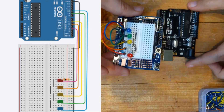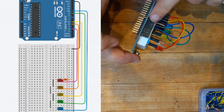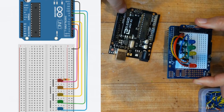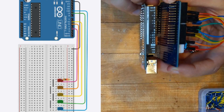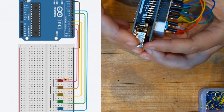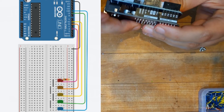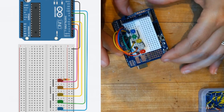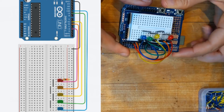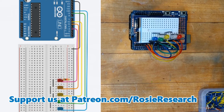What we can do now is attach it to our Arduino Uno. The way you do that is you want to line these up — there's a big gap between these two pieces and a little gap here. The big gap is between the power and the analog rails which are on the side next to the computer chip, whereas the little gap goes with the longer piece. You want to make sure that your bottom pin goes into pin zero right here — otherwise all your pins will be off by one. You get it lined up and start it in, then rock it back and forth gently so you don't bend the legs out of the way. Now we have an Arduino Uno that is ready to get plugged into the computer. We can still plug it in and access that port, it's all wired up, and it's a project we can take with us really easily. Now we need to add the code onto the Arduino Uno and we're going to do that by taking our code from Tinkercad and putting it in the Arduino IDE software.